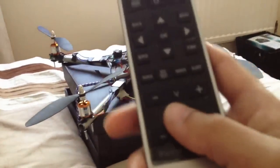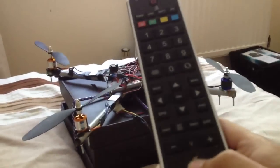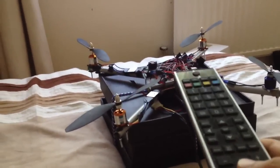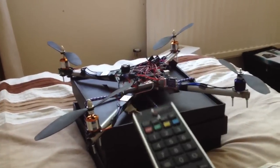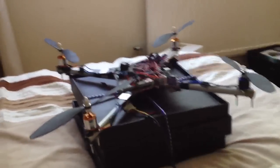What happens is when I press this button, this resets everything — all the throttles back down to zero — and it also records base values from the gyro so that the processor knows which values to aim for when trying to stabilise.